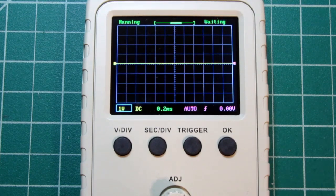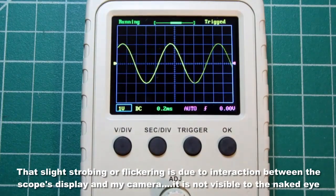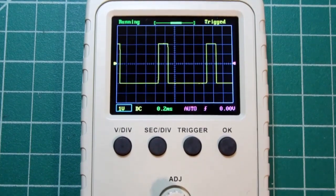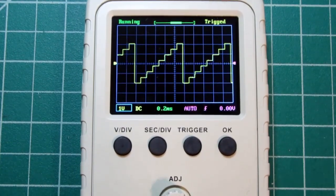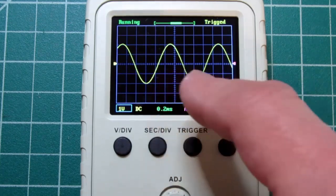I'm going to turn my signal generator on now. I have this hooked up to a Siglent digital signal generator, set up for 4 volts peak-to-peak and 1 kilohertz exactly. I'm going to turn it on and we do get a display. I have it set up for sine wave — I could make it show a square wave, or a ramp, or a pulse, or even an arbitrary waveform — but I'm going to do most of this with the sine wave.